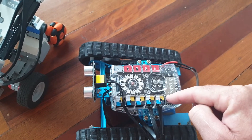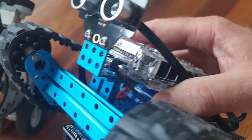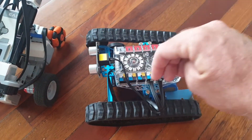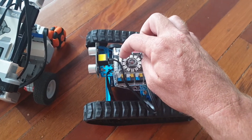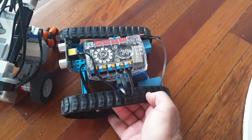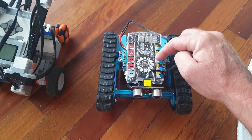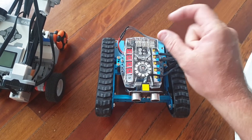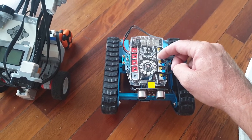On the top it actually has six sensor ports — five down there and the gray one. It also has six motor ports: four on top plus two motor ports down the front, which is what the motors are plugged into at the moment. There is also a smart servo plug just behind the gray one, where you can plug in their serial servos — quite smart servos controlled by a serial bus. Being an Arduino means any Arduino hardware can be plugged in. They have a tool for wrapping Arduino code into a scratch block so kids can use it, so anything you can put onto an Arduino, you can put onto this.